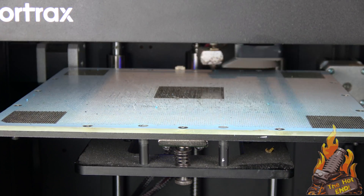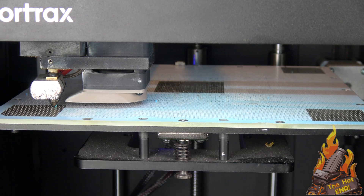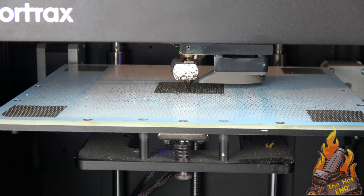Printing on a level surface to begin with, in my opinion, is much better than the printer compensating for an unlevel bed. In the ideal scenario, you always want to be printing on a properly levelled bed, rather than relying on auto levelling systems. The way that they've implemented this, with the nozzle touching the bed to get it spot on, is actually the ideal solution in my opinion.